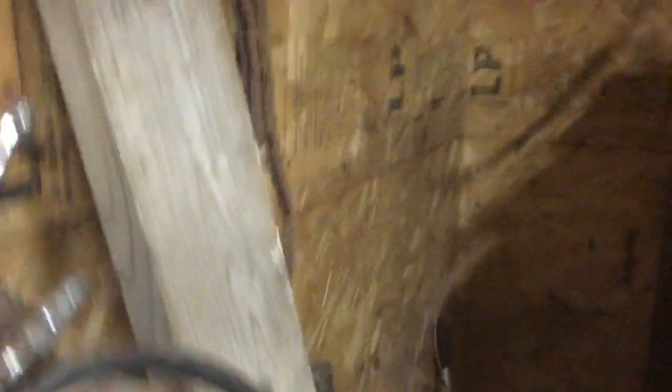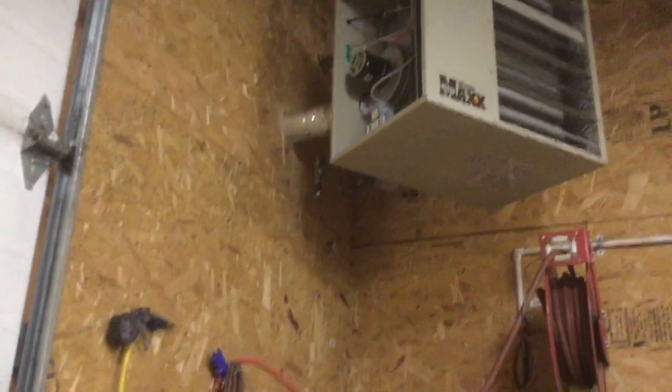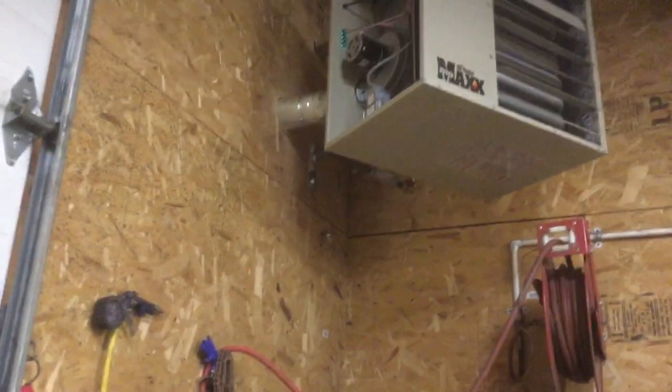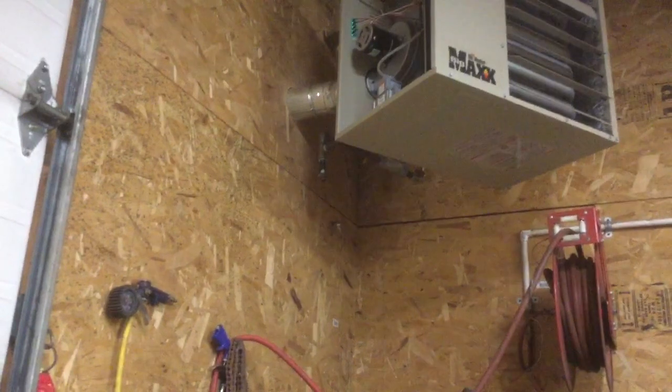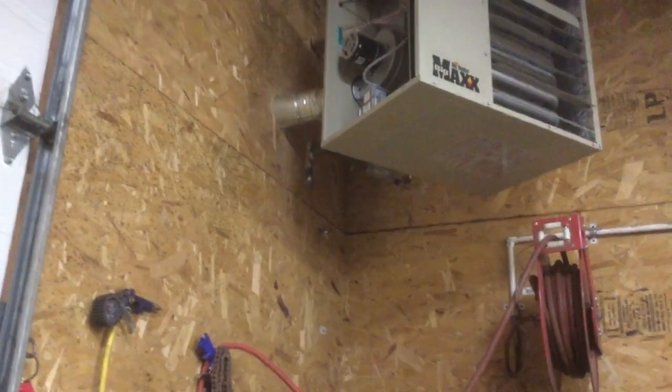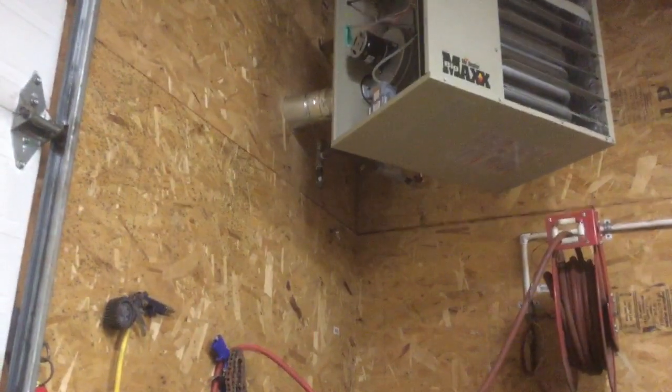Another little update: all we have left to do here is the gas is plumbed in, the regulators are on, I ran the length of wire I needed for the thermostat, and I'm just waiting for the electrician. We'll run a wire out of the box to a safety switch, then back up to the heater, do a first start, and have the burner guy adjust everything. You've got to let it run 15 minutes and then check the air to make sure it's getting the right volume. The only adjustment is on a little air intake — there's nothing on the burner itself. Then we'll put the cover back on and be done with it.